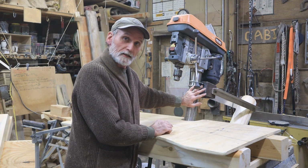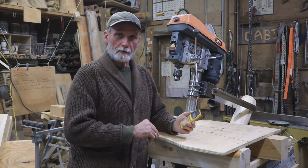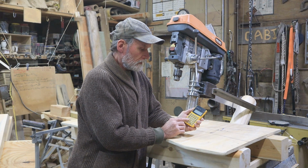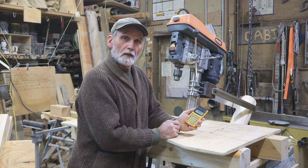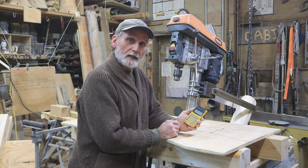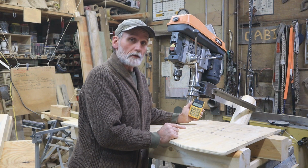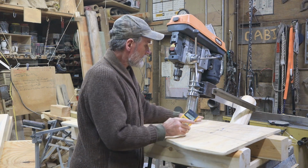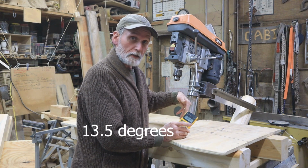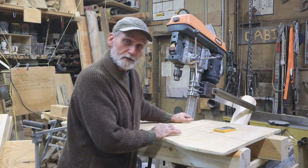So we've got 15 degrees, and I gotta go look and see what the number is. One moment. Okay, I'm back with my trusty calculator. So we go 15 degrees divided by 1.41 equals 10.63 degrees. The rungs would be at that if they were set at 90 degrees out instead of 28, but 28 is almost exactly a third of 90. So instead of 15 degrees on the rungs, if you fit them right into the legs, we could go at 13.5, and that would work out really good for the angle, but we'll get back to that later.